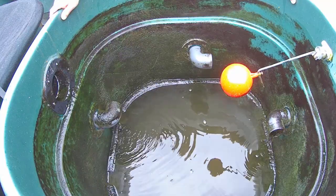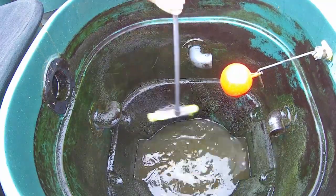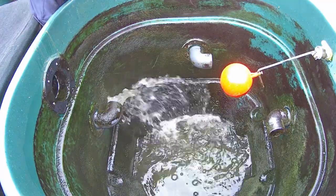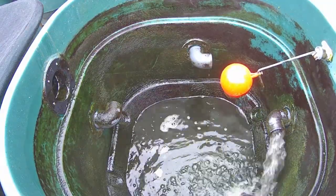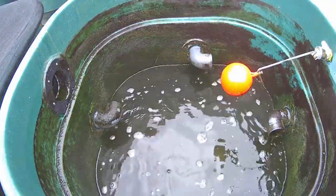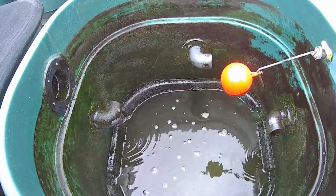When the vortex chamber is empty we are ready to perform the purge. Opening up the bottom drain valves lets the water flush through quickly. With the vortex standing empty and the pond still full of water there is a significant amount of water pressure. It pulls out any debris that has accumulated in the bottom drain pipework. You will see that the water starts clear, then turns murky for a few seconds as the debris from the pipes is expelled.